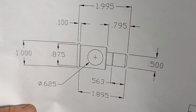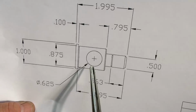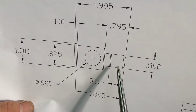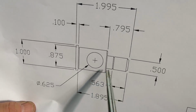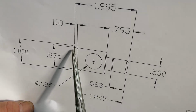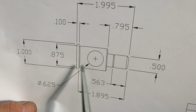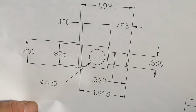All right, there's our little snug. So that hardened rod I showed you passes through that hole, a 5/8 hole. This will be threaded. I didn't show it. It's just a little thread relief there. And then this retains it in the ears on the comparator and allows us to compress it. And there'll be a bushing that goes over this that you guys will see in a little bit.